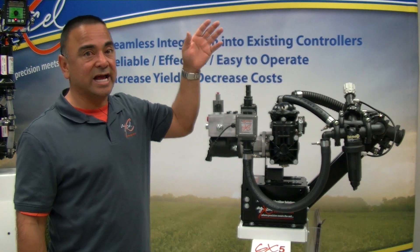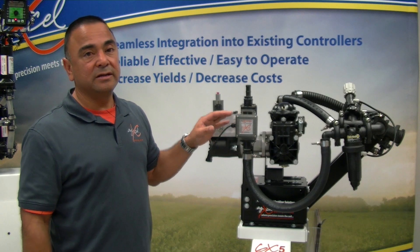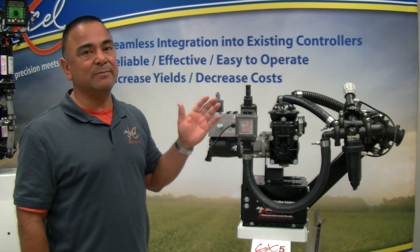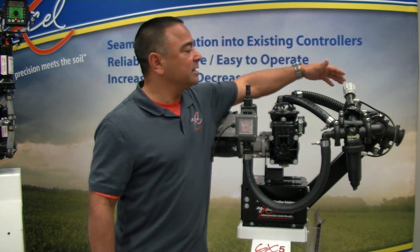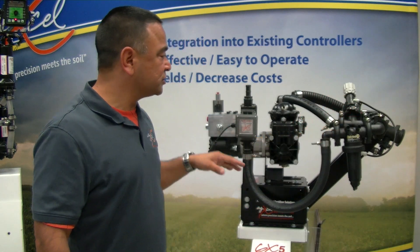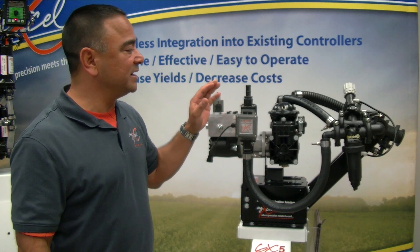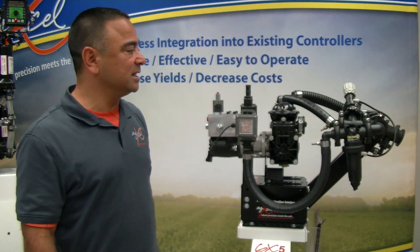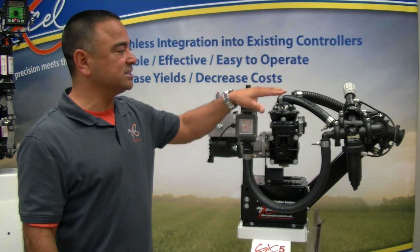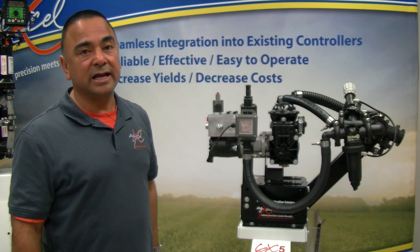If you want to agitate liquid in your tank, we can send the bypass back to the tank, set it to agitate, and still achieve your application rates. These are very low maintenance pumps that do an excellent job at low pressure. They have a good pressure range, running anywhere from 10 to about 80 PSI with no problem. There is a spike valve — if pressure hits 100 PSI due to something like a kinked hose, the spike valve opens and bypasses the liquid, and your flow meter instantly alerts you. It's just a safety precaution; these systems perform extremely well up to about 80 PSI.